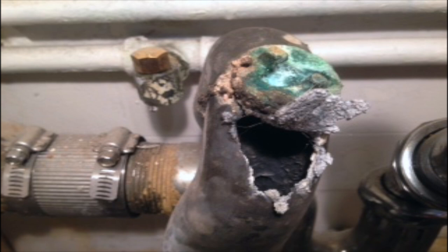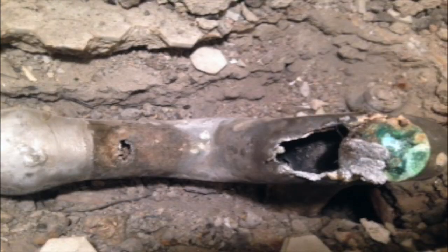I don't know why, but they used to put clean-outs on the bottom of lead traps. They knew these traps were going to be buried — why would you put a clean-out in? Still trying to figure that one out, folks. That's the way they used to do things in the old days. Over here on the right, you're going to see that blown-out trap again. In the middle there, you'll see a little hole — once he got his snake through or was pulling it back, he actually finished off a weak part of that lead. But the drain was destined to be replaced, no doubt about it.